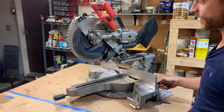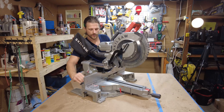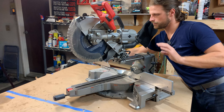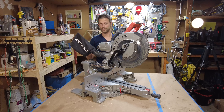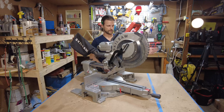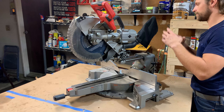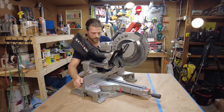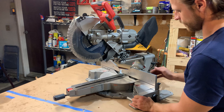You have your fence locks — a little wing nut over here; undo it and you can move your fence left and right depending on how big a piece you want to cut. On a miter saw, whatever you're cutting needs to be supported and pushed against the fence — otherwise it'll grab the wood and chuck it, bad things happen. This saw also has feet that come out for a more stable base, though I usually use it on a miter stand.